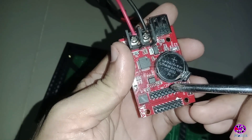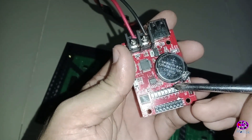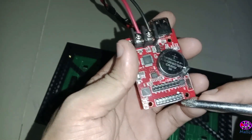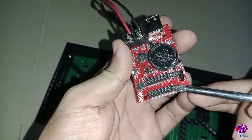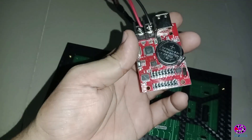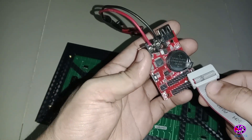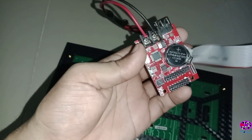This is the DMD cable which we have to connect here — see carefully. If we use just a single display board then insert the DMD cable here using the 1-into-1 connector. If we want to add a row then use 1-into-2. The arrow on the DMD cable and the arrow on the control card's connector must be on the same side.